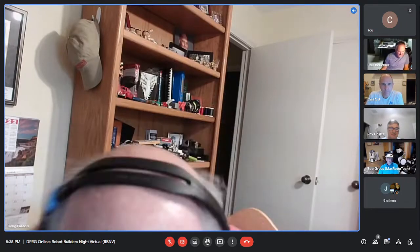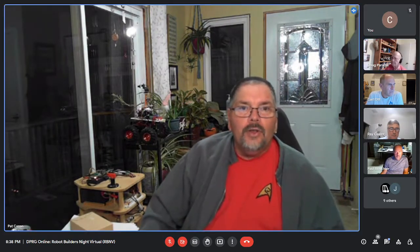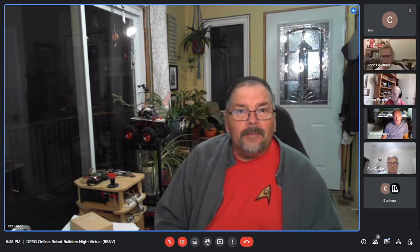Yeah, that makes sense, Carl. That's cool. I've got a question on that. If you look at that circuit, they show a buffer. In the data line, there's a bidirectional buffer, and in the clock line, I believe it's just a single direction buffer. They show the other one as dotted. How do you do clock stretching with that? If your device wants to drop the clock low to stretch it out to come up with its values, how do you deal with that for clock stretching?